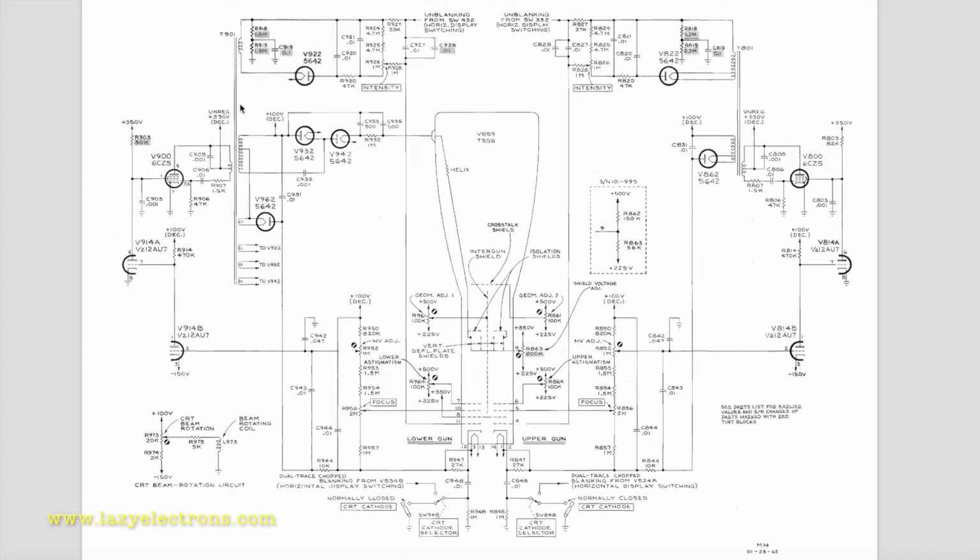Now the extra part which you have in the lower beam high voltage section is this voltage multiplier, which is used to supply the positive high voltage to the CRT anode. Now, when I say CRT anode, this is again another specific Tektronix thing. It's actually called a post-deflection acceleration helix. If you see the photos of the CRT, you can see that it's a spiral coating inside the CRT with a resistive material. I guess that's the reason they show the symbol as a resistor right down here.